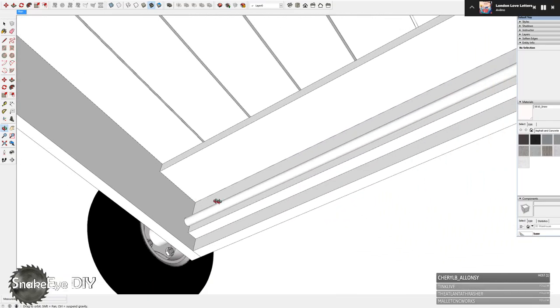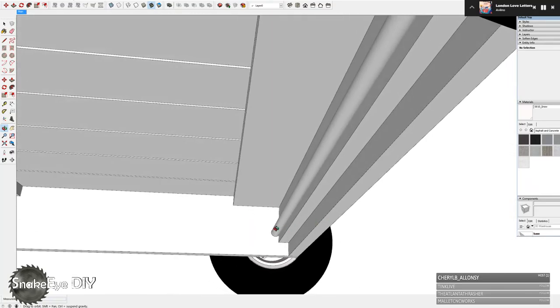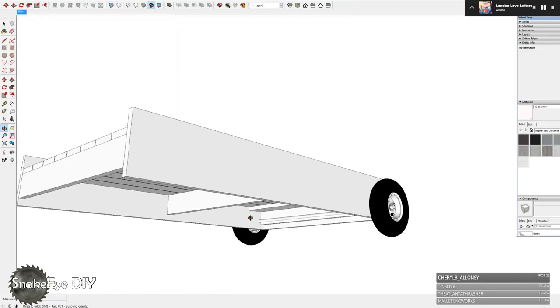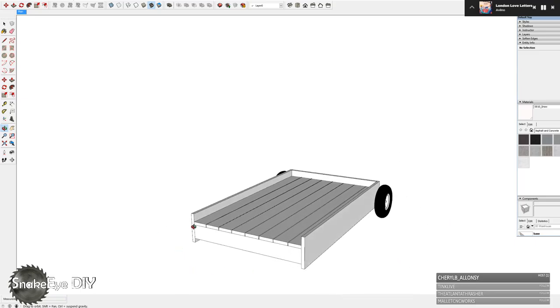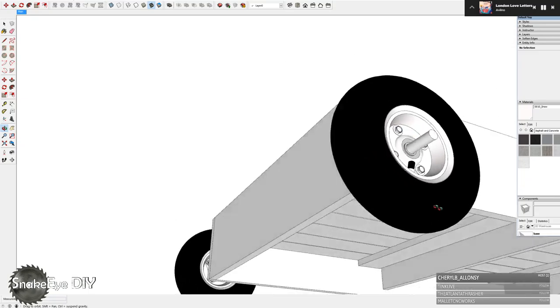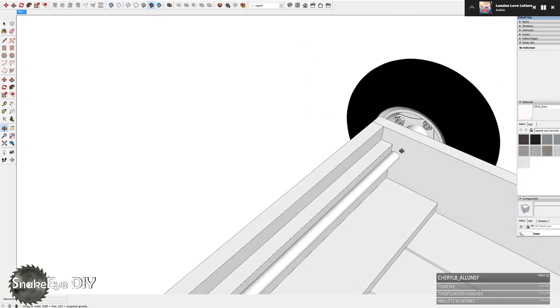And you can see that right there. It's going to hit the rod, so we can either move the rod back a little bit or get a different size board for that. So what's easiest in real life for this part right here? I would probably just move the rod. Just enough to hit the board. So instead of making the rod go in 1.75 to match the width of a board arbitrarily, I would just make it 2, and that would for sure put it in a good spot.